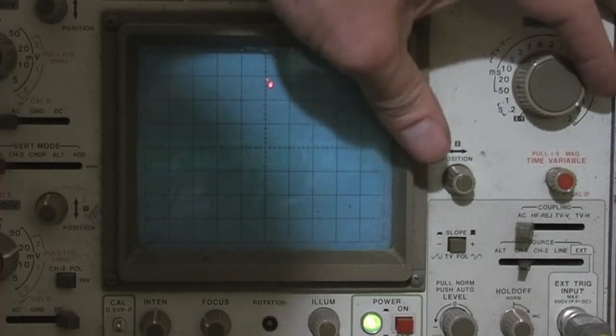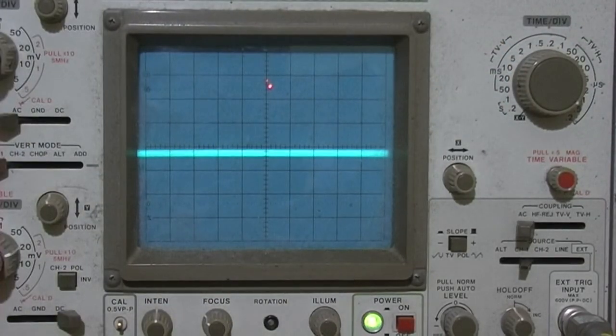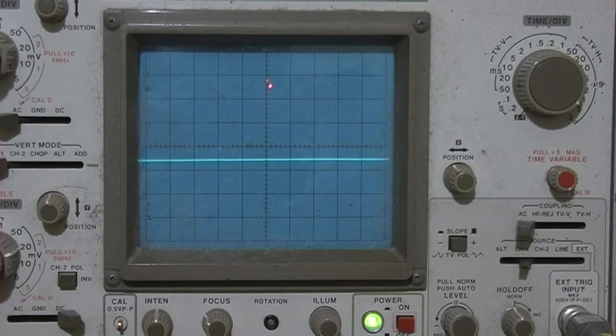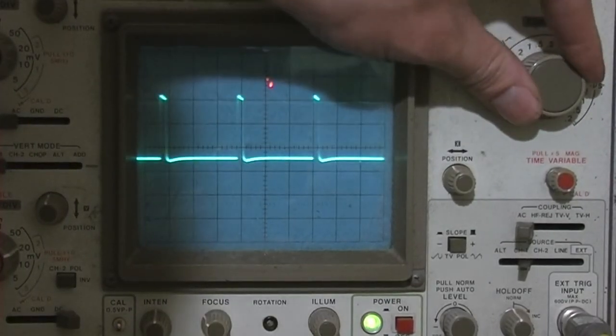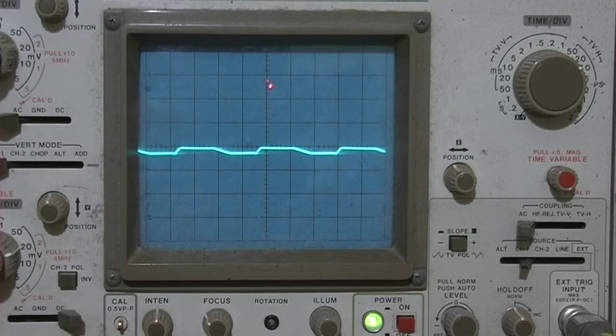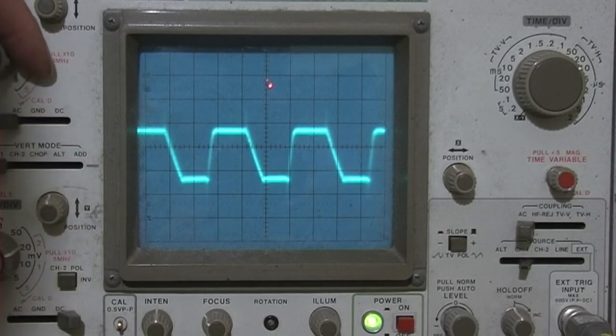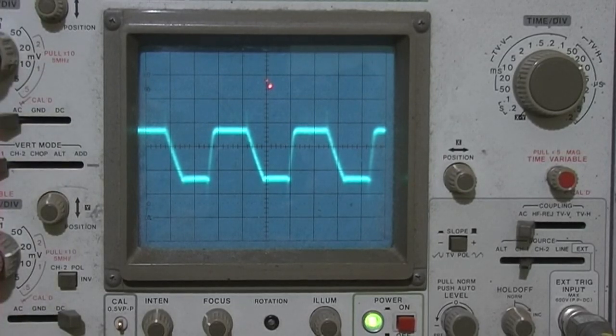It's running, whether it's the right frequency or out. This line sync goes in at pin 10, and then comes out at pin 14 to go to IC208, where it goes into the phase detector. There's something there, but it's very small.